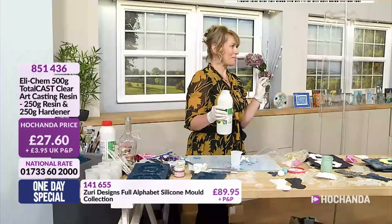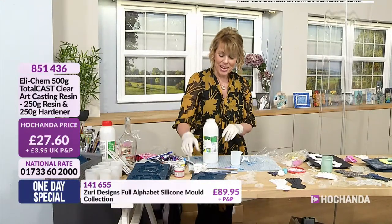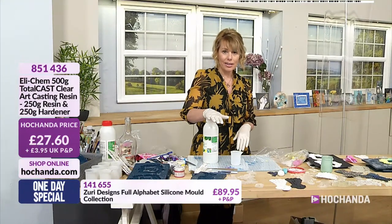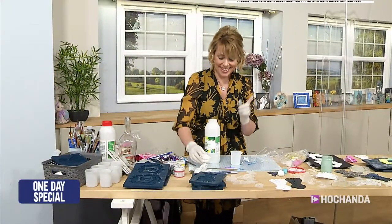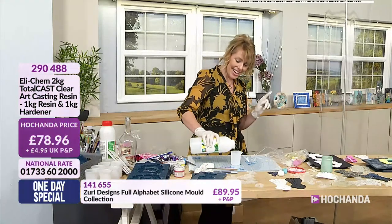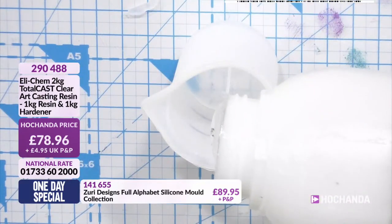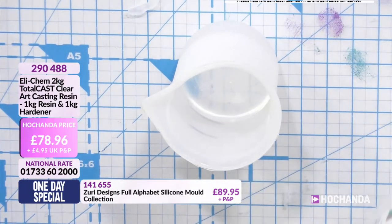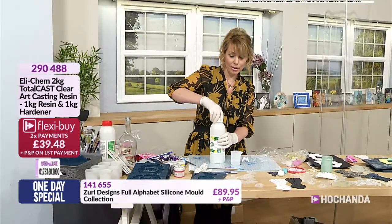I'm going to give my top tip here, and I did make a mistake when I was on last time, when Yannis spotted it. When you're using these, doesn't matter which way around you use it, put your lids on. Don't take them both off at the same time because you might mix them up. You don't know which one's your hardener and which one's resin. Yeah, this is the resin, and I said to do that last time, and then I went and took the hardener lid off before I put this one back on, and then did get them swapped over. And the fact is, if you don't notice you've done that, you will seal your lid to the bottle. Yes, because the hardener will set it.